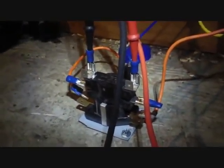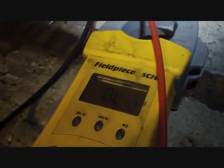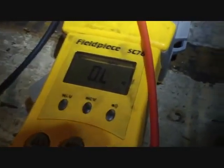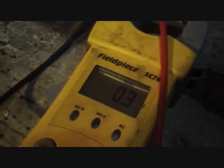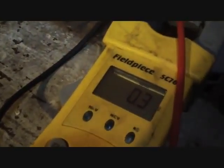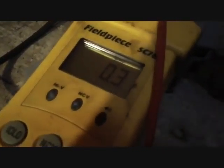If we want to check and see if that relay's stuck, it's simple. We can just put the leads where they're at with the power off and check the ohms. Right now it's open, so there's no current flowing through there and no availability of current flowing, because the switch is open. But let's plug it back in and check what it says on ohms — not tone. Power is flowing through the sequencer now, and you see it goes from open line to 0.3 ohms, so you can see that current can pass through there. If you have a suspect relay, you can cut the power to it and see if it is stuck. The same applies to a lot of different relays — you'll have a fan motor running on a fan motor relay all the time, but you can check it with the power off; you don't even need to check it with it on. A lot of times you try to trace calls for certain things and trace the 24-volt signal, but a lot of times it's just a relay that's stuck.